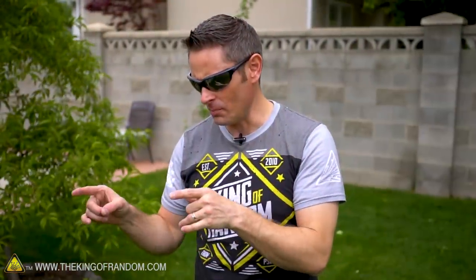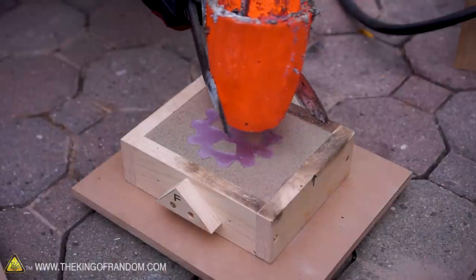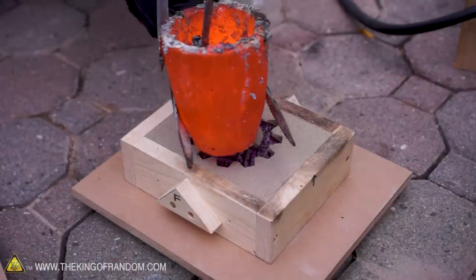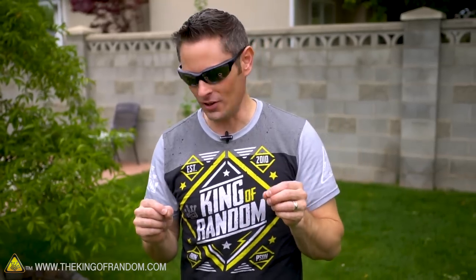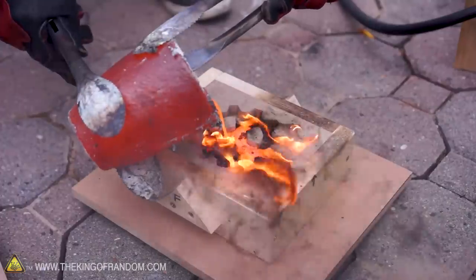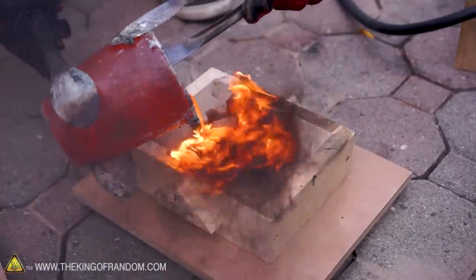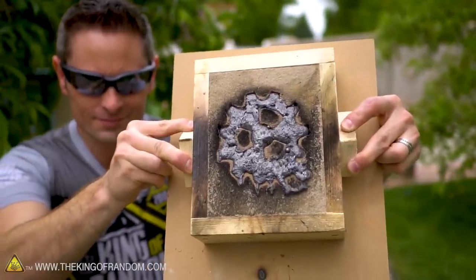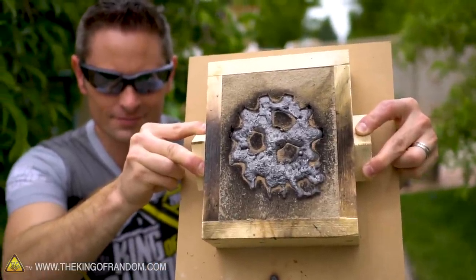You know what was really incredible about that experience was how the styrofoam just melted away under the heat of the crucible. It was actually fantastic. The cavity that it left behind in the sand was absolutely perfect. And my only concern now is as the liquid metal went in there, did it push the sand out of place, or did the sand actually have enough integrity to hold its position? We're gonna have to let this cool down for a few minutes and then we can dig it out and see. As long as we got a clean casting on the bottom, we can sand all that stuff off the top and still make it look pretty decent.